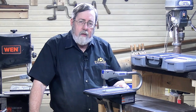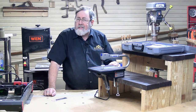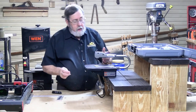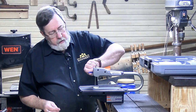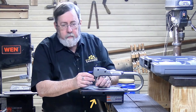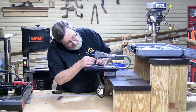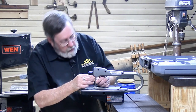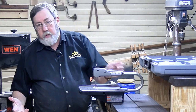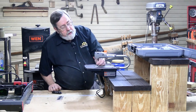When we're talking metals, we're talking tin, aluminum, copper, brass — not steel. Soft metals, maybe galvanized steel flashing, lightweight material is what we're really dealing with. Blade changing is designed to be very easy. There's a tensioning lever on the side — you flip that forward, take your blade with the teeth pointing down, put it in the slot, it hooks in the bottom, then the top. On this particular blade the pins seem a little long and I've had to twist it slightly to get it vertical, not leaning forward, and then it's tensioned. No tension adjustment to deal with. Pretty easy — once you get used to it, it'll be real easy to change blades.